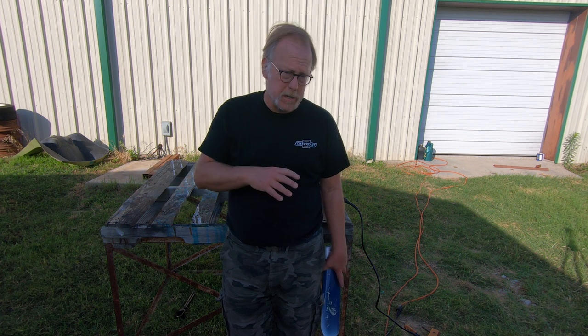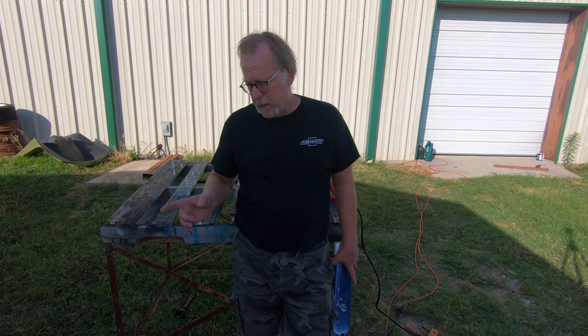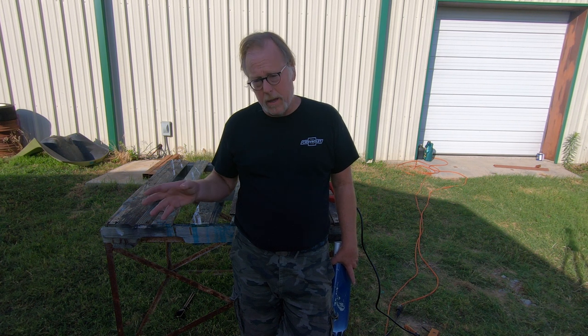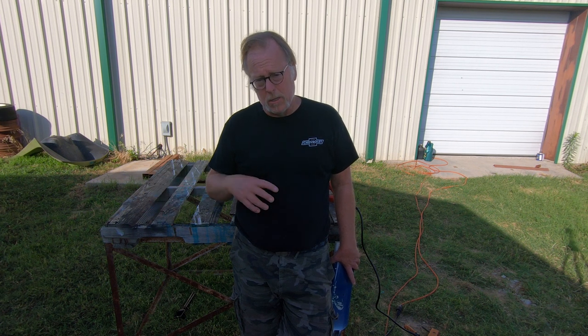So, hey, Bill, why aren't you tearing up a bunch of other stuff, taking a bunch of other things off? One step at a time. We're taking these apart, cleaning them, scrubbing them. That'll be all the step details and the handle details, getting them all done, and then they'll be painted, bag tagged, and put up, so that when it comes time to put the aircraft together, if we have the fuselage ready to go and the wings ready to go, we don't have to wait to do the lift struts. So those pieces and parts are done. You're going to see kind of a reverse of what a lot of folks do. They typically take an aircraft all the way apart, and that's not necessarily the best thing to be doing.